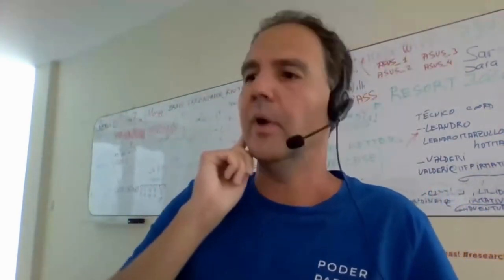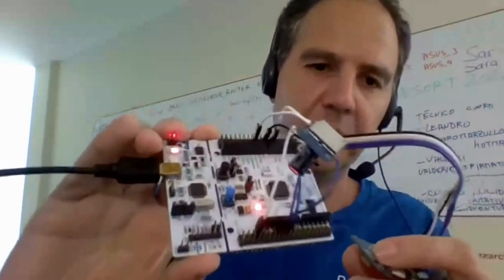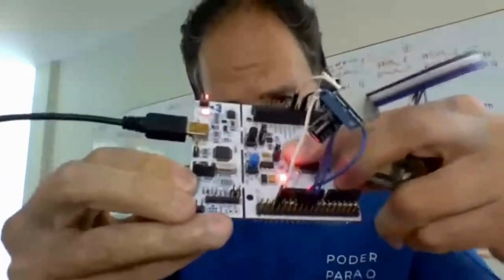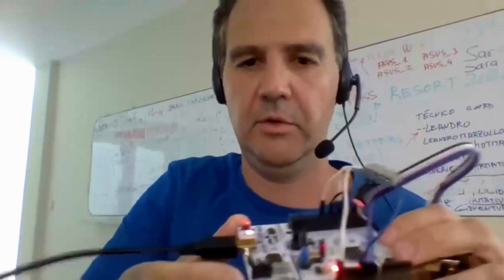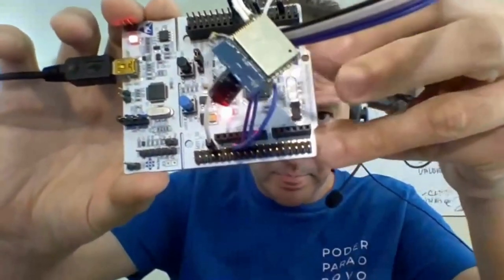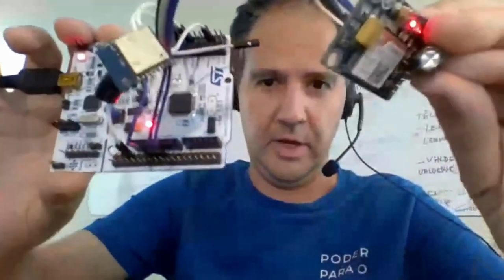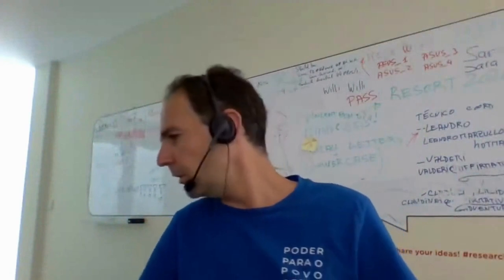The next thing is I will actually start with the live demonstration. Let me again first show the hardware. I have a little STM Nucleo developer board here. You can see the microcontroller over here, this chip. And it currently has two modules connected. In this case, I don't use the Cicada PCBs. I just connected the modules directly with these wires over here. It has a Wi-Fi modem, which you see on the top here. And with these wires here, it has a SIM800 module connected to it.